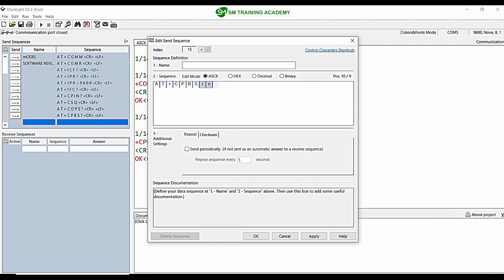CPBW is the write command. I am creating the sequence: AT+CPBW equals the memory location at which I want to store — let me give it as 1 — then a comma, and within double quotes I produce the mobile number. I have two SIM cards: one inserted into the GSM module and another in a separate mobile phone, which I will show later. I am entering the mobile number of that separate phone and then closing the double quotes.